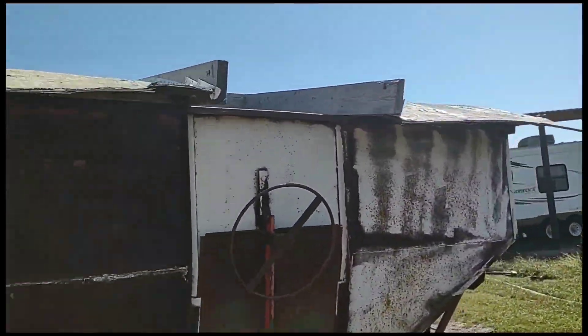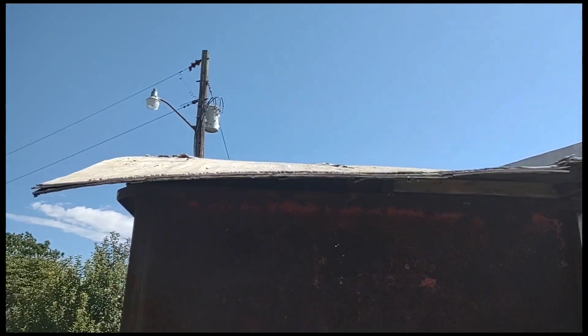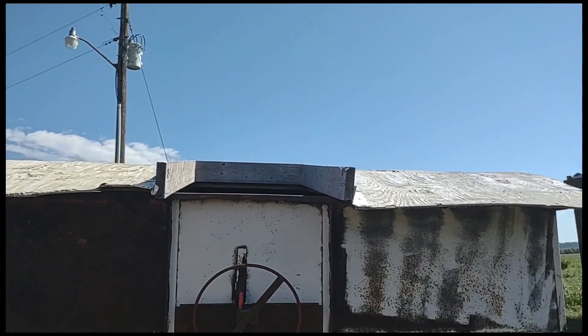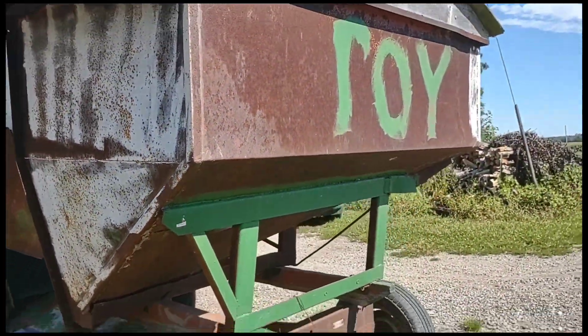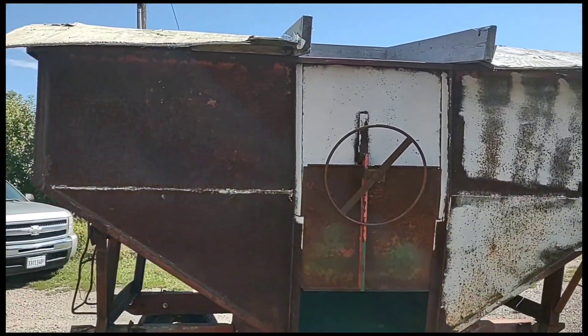Now what I want to do — as you can see, it's just plywood up there for the roof. Obviously, that isn't going to last very long. This front piece of plywood here leaks a little bit, so we're going to go ahead and replace that, and then we're going to buy some rolled roofing and put it on. That center part there has a piece of plywood that slides on and off. Coming inside here it looks pretty good — there's not very many holes at all, just a couple up there in that corner where you can see the light coming through. There's a little bit of rust underneath that stuff, and the same down over here. I just want to get my grinder and grind that down, then repaint it, and re-caulk some of these seams. I'm getting low on feed so I need to get it full, but I'm not sure if I'm going to try and buy it from a farmer or what.